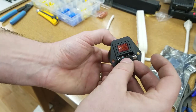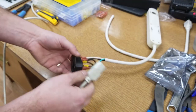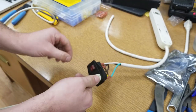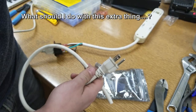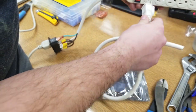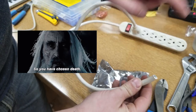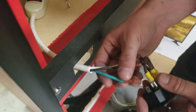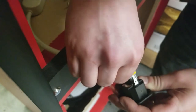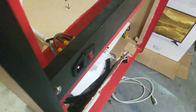The yellow connectors are not insulated — I did end up switching those out and putting in proper insulated ones, but this was all I had on hand for those specific connectors. Temporarily, I wrapped some electrical tape around it just to make sure they don't touch. The fuse just pops in, and there's also room to put a spare one, but you shouldn't need it if you wire everything correctly. The socket gives a really nice, clean look to the back — just flick it on and off.